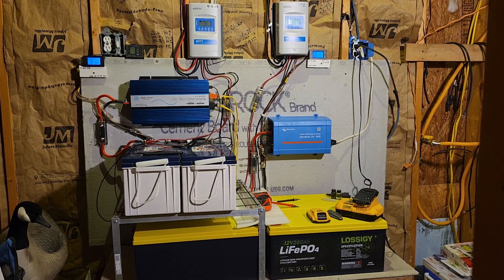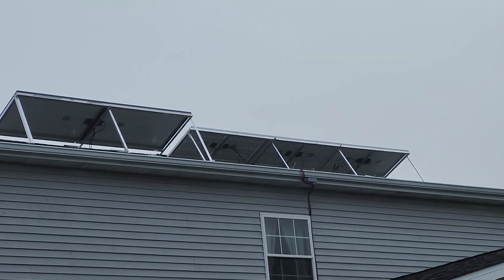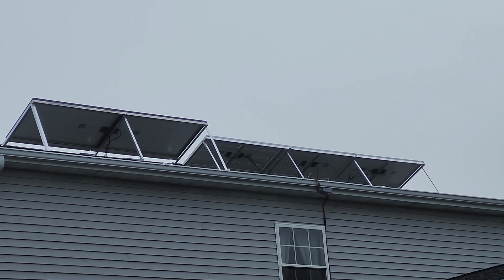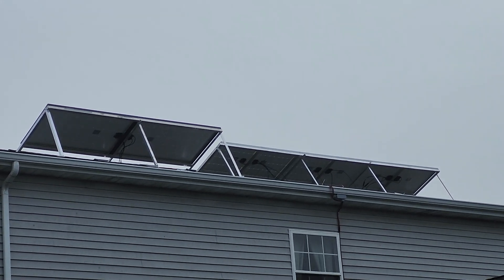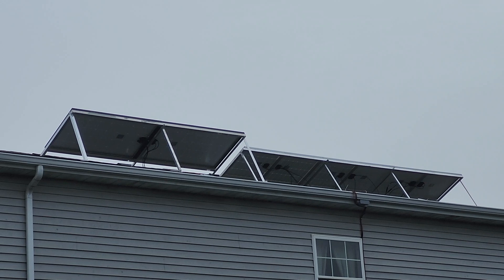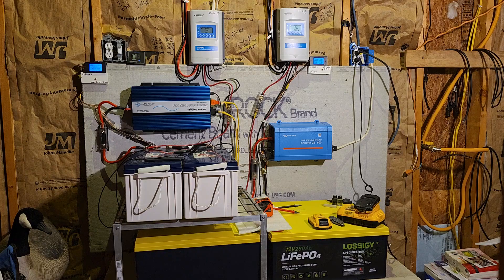I was playing with editing a little bit, so we'll see if I can do that here. And that's what's up on the roof now. As you can see, there are three sets over there on the right and they're laid back now at 21 degrees. The new racks I made will lay back to 21 degrees for the summertime and 38 degrees for the wintertime. On the left there is the pair of 250 watt panels. Hopefully the editing turned out well, but that's it for this one.